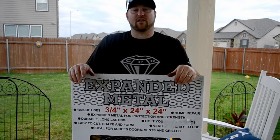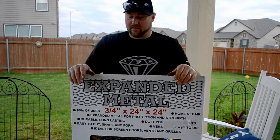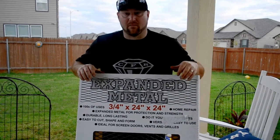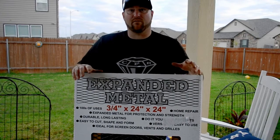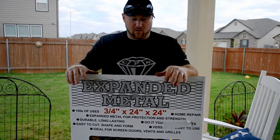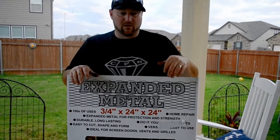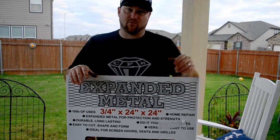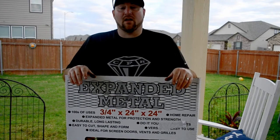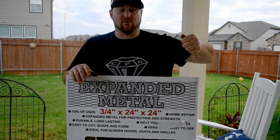Now we're going to do the modification. We're going to use this steel here that we got from Home Depot. Again, not sponsored by them, but the expanded metal works really good to improve your fireboxes, make grill grates. You can do a lot of different things with it, but today we're actually going to do a no-weld firebox, basically cutting out the dimensions of my firebox, which I pre-measured already prior to the video, to make sure I had the right dimensions. We're going to cut the pieces out, fold it up, and then use baling wire to tighten it down.